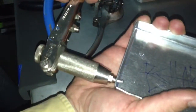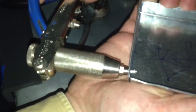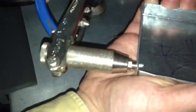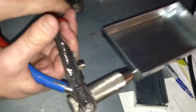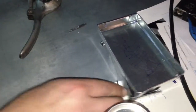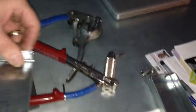As I squeeze this handle, we can see the mandrel expand, and then I kind of have to choke up on it again. Once it's squeezed, release and choke up, then squeeze again. You may have to choke up one more time and squeeze. You might have to use two hands — do not get your hands in between here, that would be painful. Keep your hands on the outside and squeeze together until it pops. The shank should slide out of the center, and we have a pop riveted corner. Repeat on all four sides.